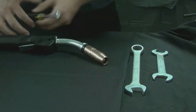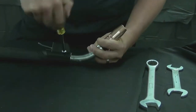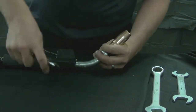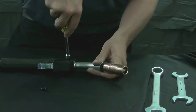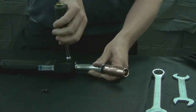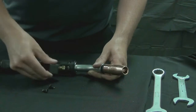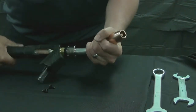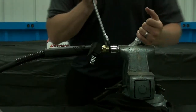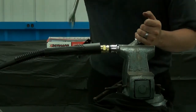To change a fixed neck to a rotatable neck, start off by using your 5/16th nut driver and thread the housing screws counter clockwise. Move the switch housing and slide the handle back so the cone and cone nut are exposed. Using a 7/8th wrench, place it on the cone and unthread counter clockwise.